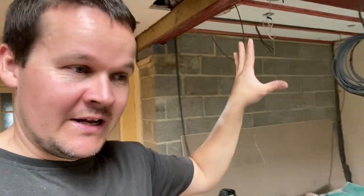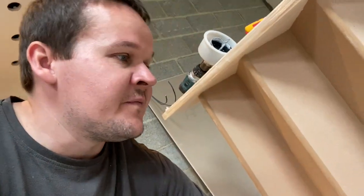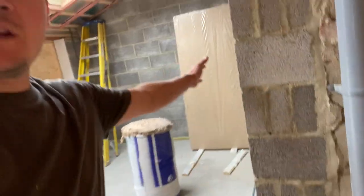Back at the job. I've started to wire the lighting, getting that all sorted today. Power and lighting is going to be done today, and then tomorrow central heating and cooker circuits. I've picked up a bit of unistrut. I've got some plastic capping just on the walls because they're going to bond the walls out, so I can just fix the boxes and cap the cable. I haven't got to do any chasing as such.